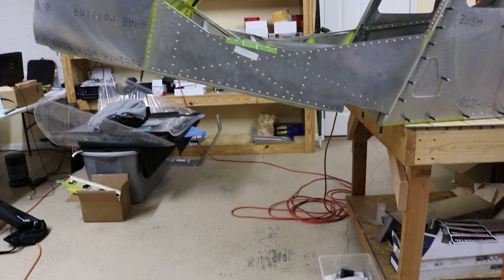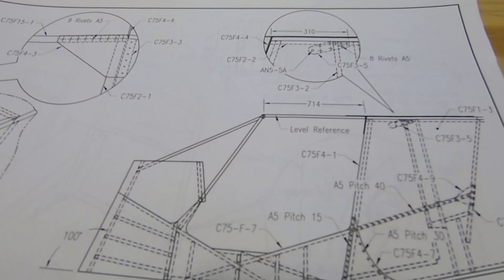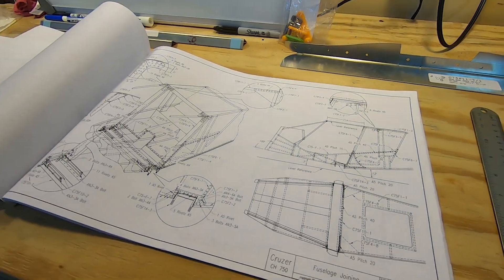As you can see, the cabin frame is on and in place. I put it up on the table, supported the front by another table, got my zero reference which is on top of the cabin frame - zero completely level on top of the cabin frame. The rear as it comes up, the plans show to be at 12 degrees, the belly of the plane is at three, and then the firewall is supposed to be 100 degrees back - so essentially about a 10-degree tilt on the firewall. All those things are in check.